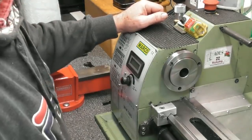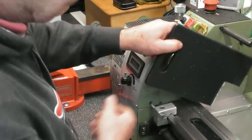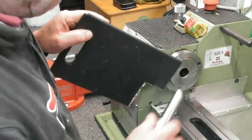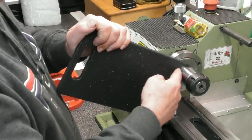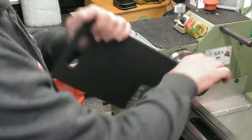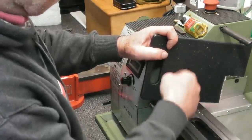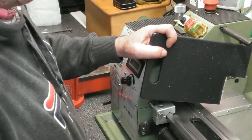I haven't got a piece of aluminium that big, but what I have got is a plastic chopping board. It's about 9mm thick, so that shouldn't cause too many problems — I'm going to have to machine it down a bit so the register fits. I'll cut myself a piece about 105mm diameter, roughly mark it out and chop it off with a hacksaw, then get it in a three-jaw chuck and start machining.